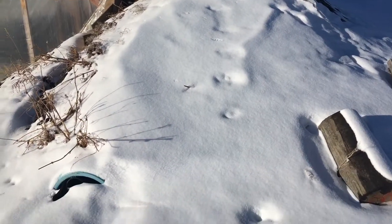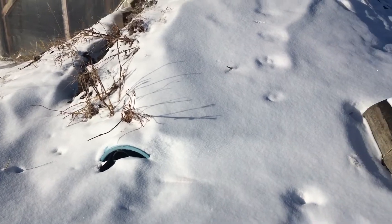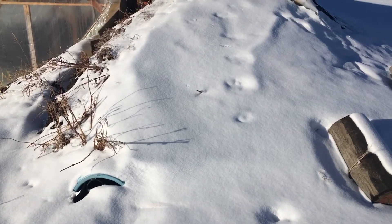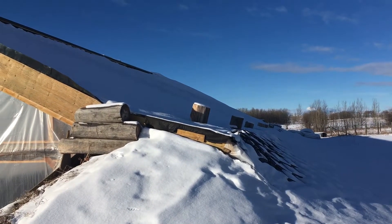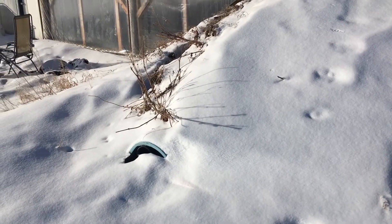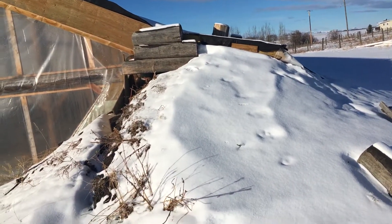In the back of the hill here you'll see this tube in this area. This is one of the large drain pipes actually from the city of Calgary that I got used for just a few dollars each instead of a thousand bucks each, and they run 200 feet. There's two sections. The first section comes in at that end and that's for the air intake because that's west and the wind comes from the west. This here is the exhaust and the exhaust is on the bottom. When the exhaust air comes out the bottom it heats up the soil mass that's around the pipes in the ground.